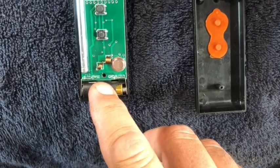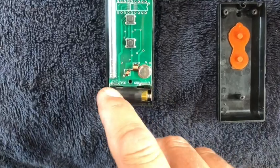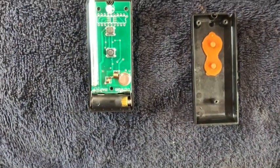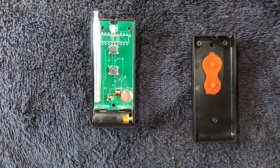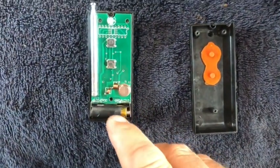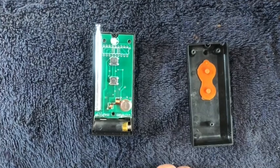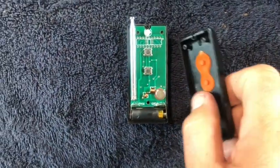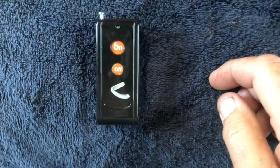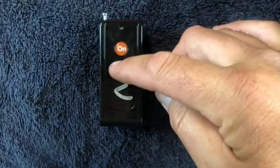These remote controllers run on a 12-volt battery. So for my override, I soldered wires onto this as well — get your plus and your minus. I have a power supply that has 12 volts, and I put a switch in between the power supply and the power for this. So when you turn the override on, it actually disconnects one side of the battery, and that's why the remote controller will not work. The other nice thing is, even though you solder wires onto this, you could actually still use the switches. So if I needed to in an emergency — let's say the switch failed on the top — I can reach over and still hit the stop button on the remote control and it'll still work.